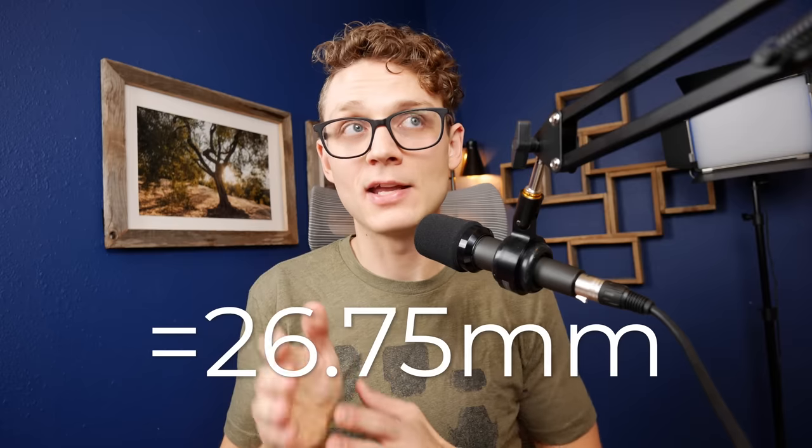This is what makes mirrorless cameras so cool and why adapting vintage lenses has surged in popularity. Mirrorless mounts have such a short flange distance that you can adapt almost any vintage lens to them, because there's almost always enough room to achieve the full focus range designed for that lens. DSLRs are generally harder to adapt to because the mirror box means a larger flange distance, leaving little or no room for an adapter. The formula is: lens flange distance minus camera mount flange distance. If that result is a significant positive number — not just 0.01mm, but enough to physically create an adapter — you're golden.